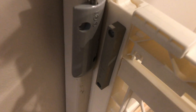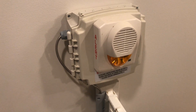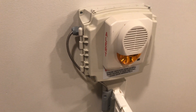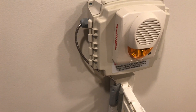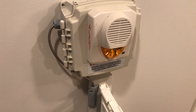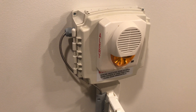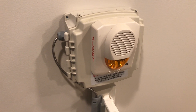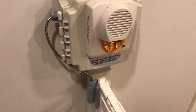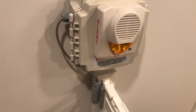So yeah, this was a fairly cheap setup. It's just a typical door contact — there's a magnet bar in the gate, a magnet switch inside, and it will scream at you that the door's open too long. You can easily make one of these with one of those switches and just make the horn go off immediately with a simple switch, but this one has timers in it, which I like, so you can have the gate open to actually do stuff and not get screamed at. It's pretty easy to build at home.